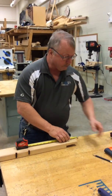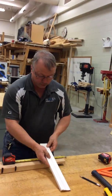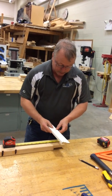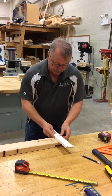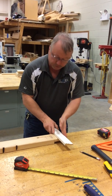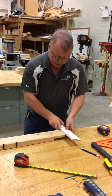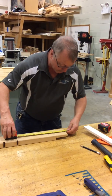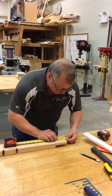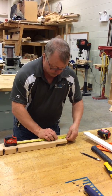Now, let's say this represents the 1 inch line on your ruler. The way I put it on, instead of the 1 inch sitting over here on the outside and measuring, I set the line of the 1 inch flush with the outside edge. Okay? Not in the middle, not over here, but right on the edge on the inside. So when I'm burning an inch, my line is to the inside of this edge, the number 1.